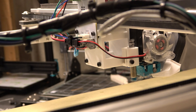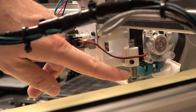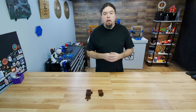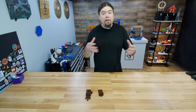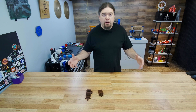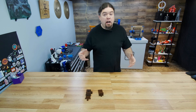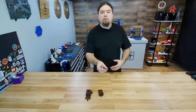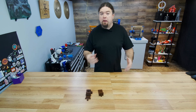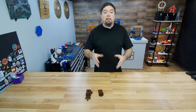Just one more shot from behind — what I was really going for with this layout is getting that inductive probe lined up as well as I could. On the Y axis, it's pretty much even with the nozzle. With a printer like the FT6, you want to print large objects because of its build volume — that's why I bought it in the first place. But with larger prints, you're going to increase your print time and your exposure to failure. You're going to lose a lot more filament and time than on a smaller object, so you want something that's going to be really reliable. I've had a lot of luck with the Hemera in the past, and its ability to print flexible is going to work for the project I had in mind.